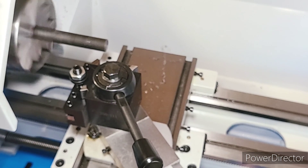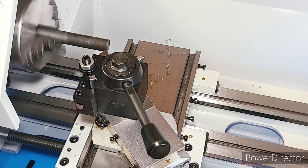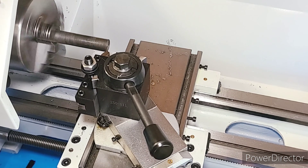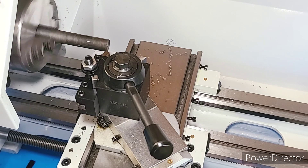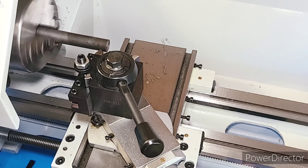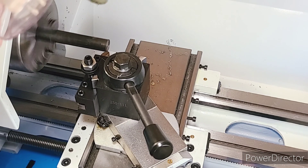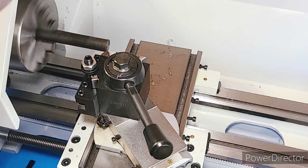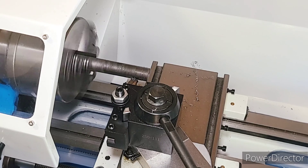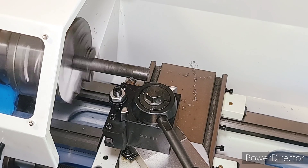We'll bring her over and come forward until we just touch off, then back that off and zero this out. Let's do two thousandths of an inch — that shouldn't be very much. You can see we are barely doing anything, so I'm actually going to back that out and make a deeper cut. Let's do five thousandths of an inch and see what that's like. Seems to be a bit better. Let's go ahead and pick our RPMs up just a little here — now we're at 175 — and it still seems to be cutting pretty well.